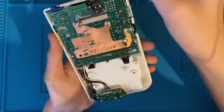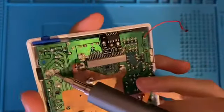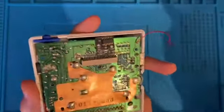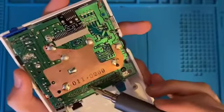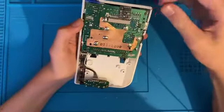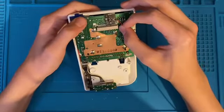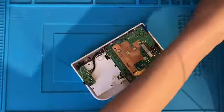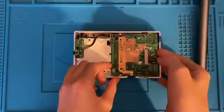I can also see there's water damage on the board. On the DC jack here, all this white stuff is water damage. There's a bit on the power switch, a tiny bit on the link board. But more importantly, there's some on the game cartridge connector, which isn't good because water damage can short the pins. I'll clean that up. Is that what's causing the funny image — the ground not being connected? The first thing I'm going to do is take this whole back motherboard out and look at the other side.